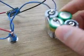I'll put the red lead where the blue wire is connected to the positive terminal of the battery, and the black lead to the negative return path. The circuit is now complete. The driver is working and, as you can see, we've got a measurement of 106.3 milliamps. That's what I want for my Blu-ray laser diode, because the PHR803T should be driven between 100 to 110 milliamps — otherwise it may exceed the rating and shorten the lifespan.